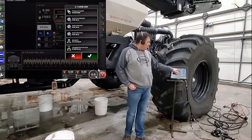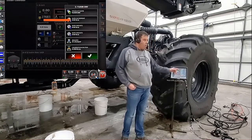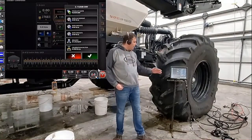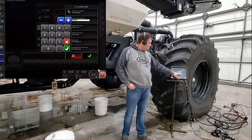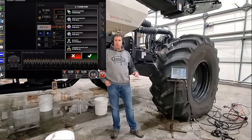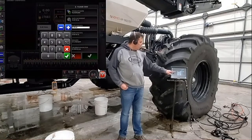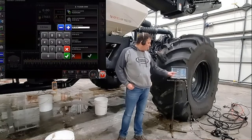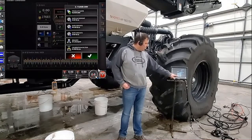So to start with your product name, below that you have your rate increment. You can enter it now, or if you have built your products prior to seeding or from years past, you may already have that in there. We'll touch on it and put a rate increment of five pounds, then press OK. We're going to want to make sure that we have a preset rate one and two in there as well. So we'll touch on preset one and calibrate floor dry at 90 pounds, then preset rate two at a hundred pounds.